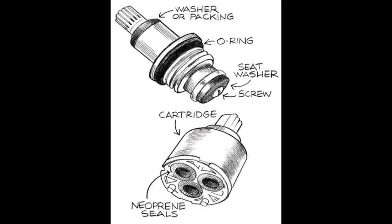What to do. Step number 1: first, refrain from dumping any goo down the drain. And if you do and wind up calling the plumber, be honest about what you poured. Someone could get hurt. These products can contain noxious stuff that could burn skin and produce toxic fumes, especially if combined with other off-the-shelf potions. Step number 2: before you start pushing on the plunger, plug the overflow drain, that peephole in the actual sink, often just under the faucet, with the rag. But don't let it slide into the hole. This closes the circuit and creates suction.